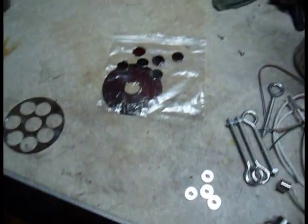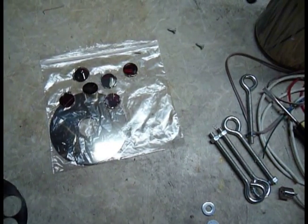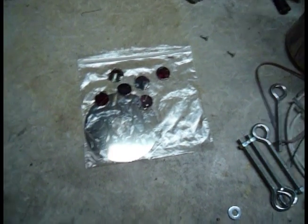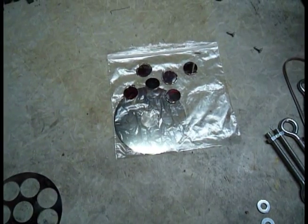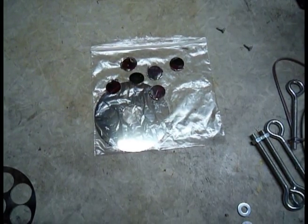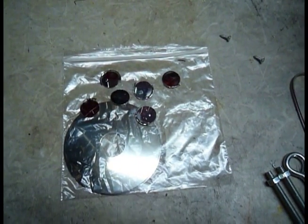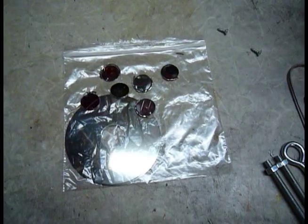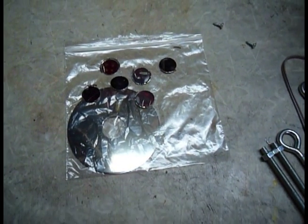We've got six to play with, and you only need three for a laser cutter, but it's good to have backups. In the hard drive I tore apart I had four platters, so technically if you could get seven good mirrors out of each platter, and there's four platters, you could have 28 mirrors — quite an abundance. That's how you get the mirrors out. When I get my thermal adhesive and heat sinks, I'll show you how to build up the rest of the mirror mount so you can use it for focusing or properly angling the mirror for laser alignment.